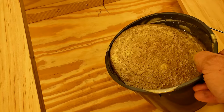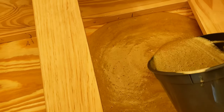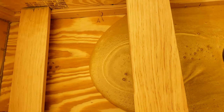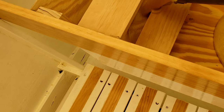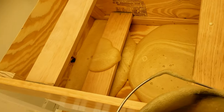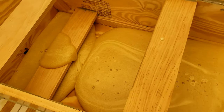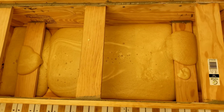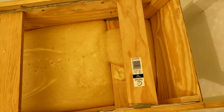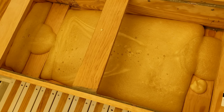This is another product from Total Boat — it's a two-part mix. You have to work quickly with this. After mixing it, you pour it into the cavity of where you want it to expand. This is a closed cell foam, so it won't absorb any water. Once it's cured, it forms millions of tiny little pockets that hold air to create the flotation. Here I've sped the video up about double time. You can pour more foam on top of the other foam once it's cured — that's not a problem, and doing so allows you to work in batches.